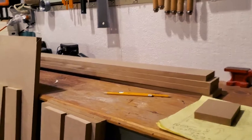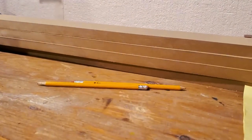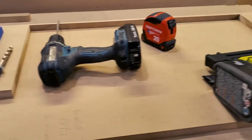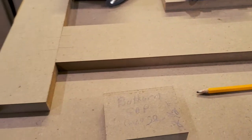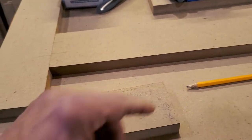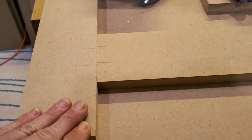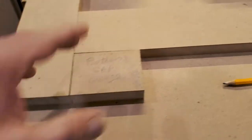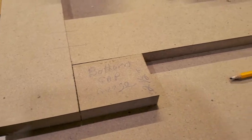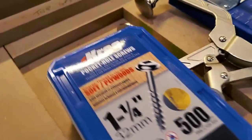I'm pretty proud of myself because I usually cut 10% more than what I actually need, because inevitably I'll screw something up and need to re-cut. I have a face frame laid out on my bench with the verticals and horizontals, and I created some gap blocks. This will allow me to be consistent on all the radiator covers so they're all the same. This two-and-a-half inch block gives me the exact distance I want — a two-and-a-half inch gap on the bottom of the radiator cover — and I'll do this on all sides of all covers to be consistent.